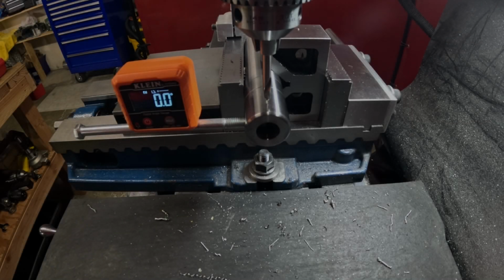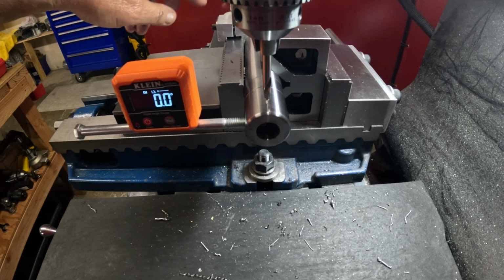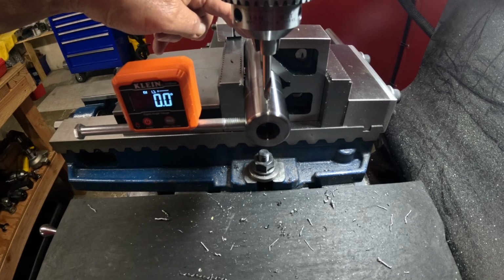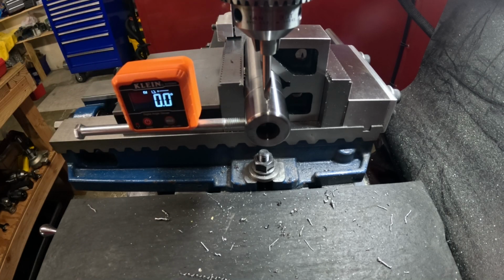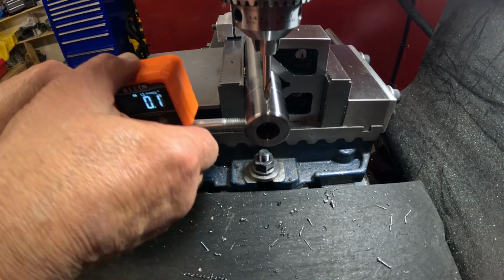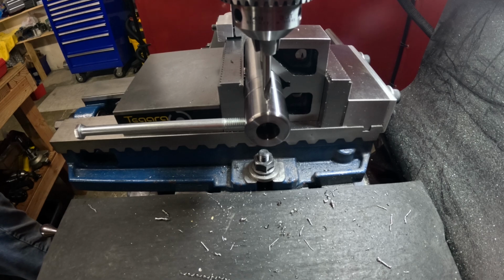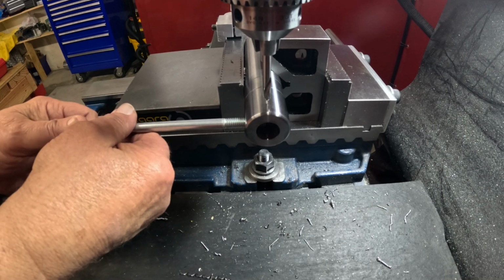Well, as you can see here, I spun it 90 degrees, put my stop in down here on this end so there'd be the same spacing on the holes. I've got a long 3/8 bolt stuck in there and my magnetic level, and we're level right now, so that puts me at 90 degrees to that other one. So we'll punch this in now and get this done with. Better take this stuff out of the way here. This thing out of here.